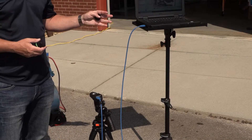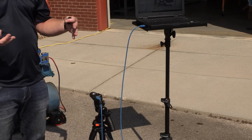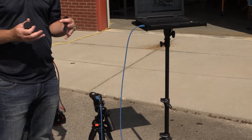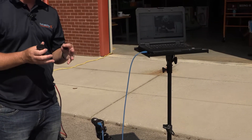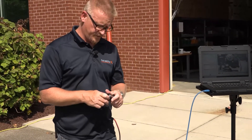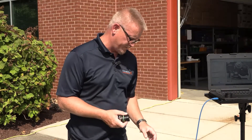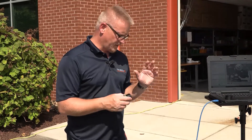As we noticed in the picture, we weren't really seeing the entire unit, and we want to start by looking at the entire unit — we may want to focus in on a very specific area later to zoom in, but for now we want to see the whole unit. So we're going to swap the 25mm lens out for the 12.5mm so that we can get a broader picture. We'll then adjust our focus and aperture again.